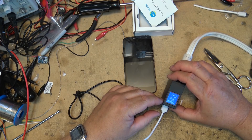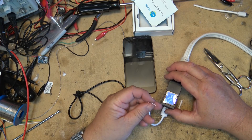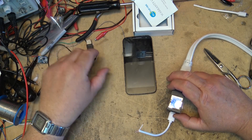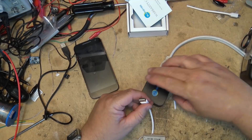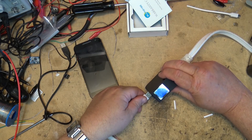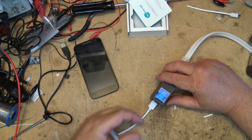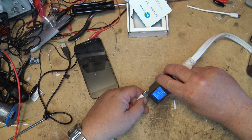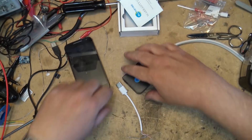After knocking the unit down briefly, when I removed the short it came back. It says 'overload — USB 2 was overloaded.' So that's what happens when you short something out. Next we'll put a resistive load on it to try and take this thing to its maximum. We'll try a 1.8-ohm load and see how much we draw. The result: 2.62 amps — and it's still showing overload.